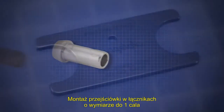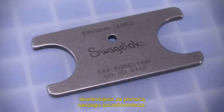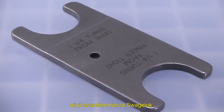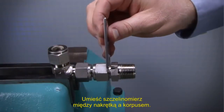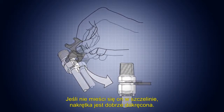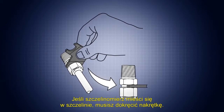The tube adapter end for one inch and under is gaugeable using the Swagelok gap inspection gauge. The gauge assures the installer or inspector that the fitting has been sufficiently tightened. To use the gauge, position it next to the gap between the nut and the body. If the gauge will not enter the gap, the fitting is sufficiently tightened. If the gauge will enter the gap, then additional tightening is required.